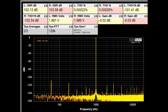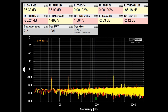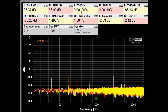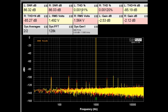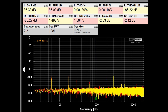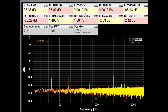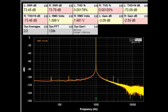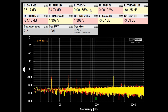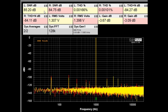Now I'm turning on the C9 with the injection ratio set to normal and the listening aperture set to narrow. You can see we've got a little over 2 dB of loss depending on the channel. Distortion is still really low at less than 0.002%. SNRs are above 86 dB. The specification for THD should be better than 0.05% from 20 Hz to 20 kHz with a 2V RMS signal — it's performing much better than that. Switching the injection ratio to theoretical didn't change the THD greatly; the loss changed by about 1 dB and SNRs didn't change much.